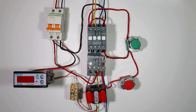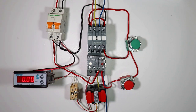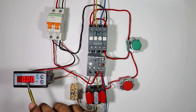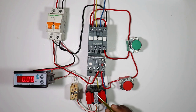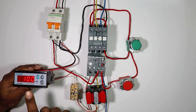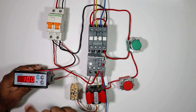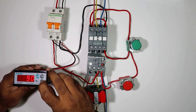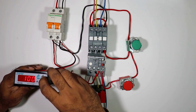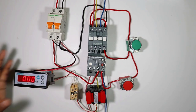Connection of this digital ammeter is now completed. Now let us check by turning on the power supply. I turned on the control power supply and you can see the display of the ammeter is on. After turning on the display you have to do programming. This CT has a ratio of 100 by 5 - the ammeter already knows the secondary current is 5A, but how much the primary is we need to program. Press the set button once - here you can see 100 is written, meaning I already programmed 100 by 5. By using up and down buttons you can change this. Suppose your CT is 50 by 5, then set 50. Right now I have a CT of 100 by 5, so I am selecting 100 and pressing the set button. Programming is done.